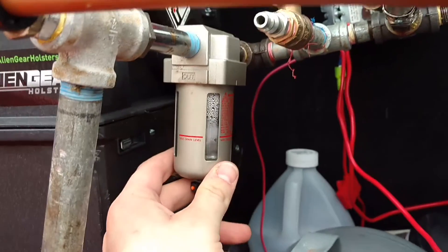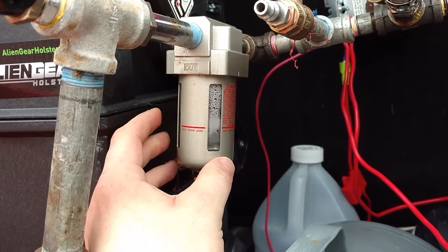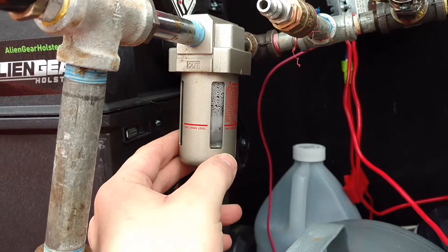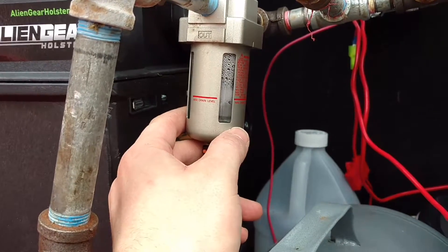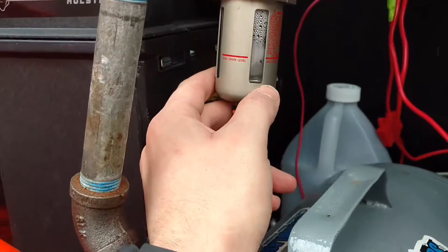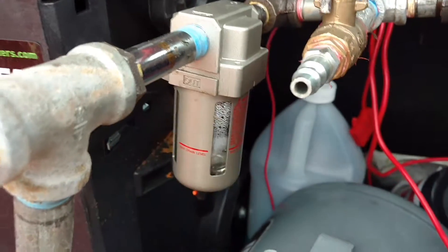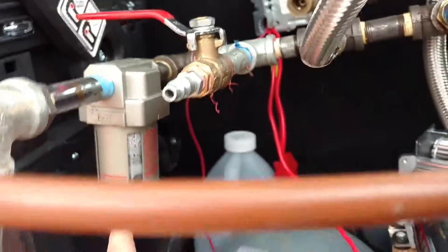This is the little separator. In one of my previous videos, I have an air filter that took out to about 40 micron in overall size, but this one actually gets down to 0.01 micron. This thing is the best of the best and you can see I got a good amount of water in there. I have not emptied this in quite a while.